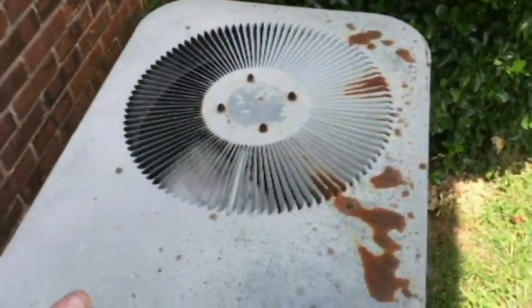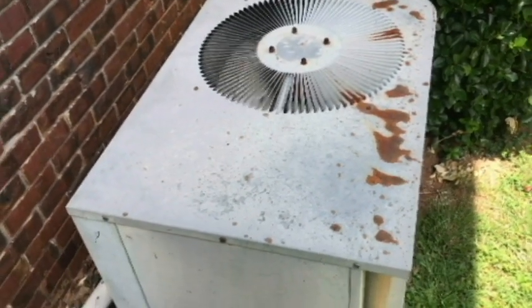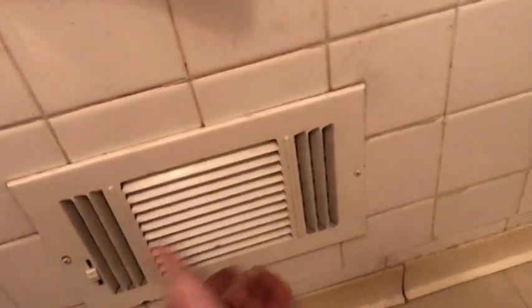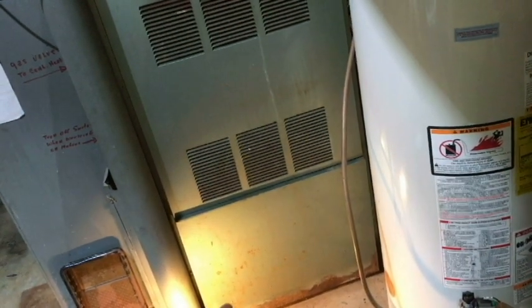I just turned the AC on. That has always been good as far as I can tell, but with the new capacitor we'll see how it's working. Let's check the vent — okay, yeah, it's cool. Wouldn't necessarily say cold, but it may get there. So it's working. Thanks for watching. That was replacing a capacitor that was 21 years old — from 2002. Also, I want to make a note: I'm using a magic marker to write the date on the capacitor so anyone else who works on this — including myself — will know when it was put on. Thank you for watching, until next time, have a nice day. Take care.